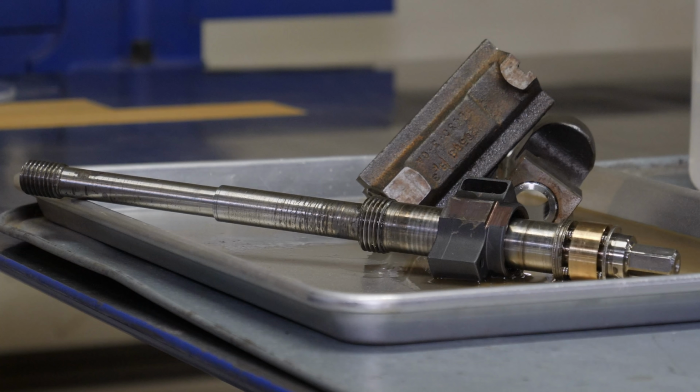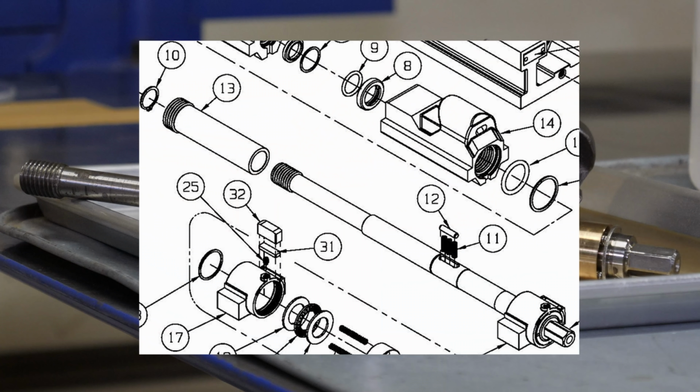This is as far as I disassembled the vise. There is a clip that goes right here that is kind of unique. I've never seen any kind of clip like that, and I was unable to take it apart, and it's not shown on this diagram. It's not number 10, but it's the clutch mechanism, which is 11, 12, and 13. If you've ever taken that apart before or you know about it, please leave a comment below and let us know. Despite the fact that I didn't take that apart, I was able to flush it thoroughly and get it to come clean and lubricate it.